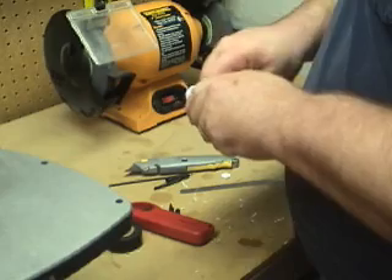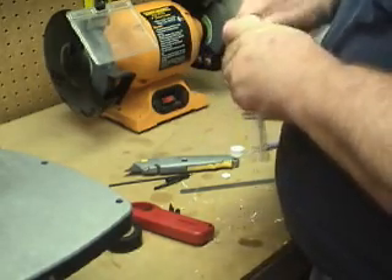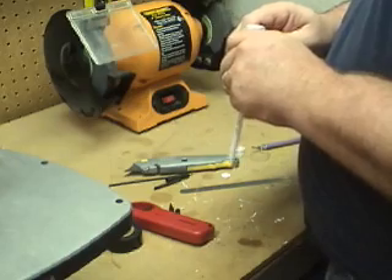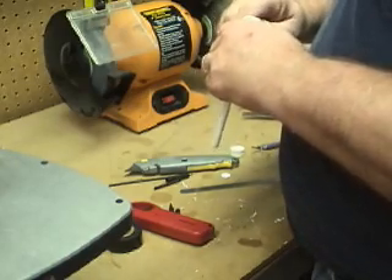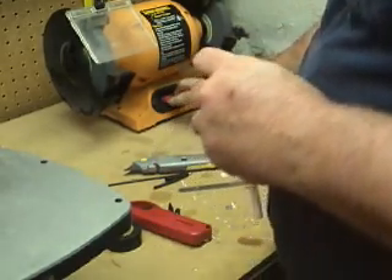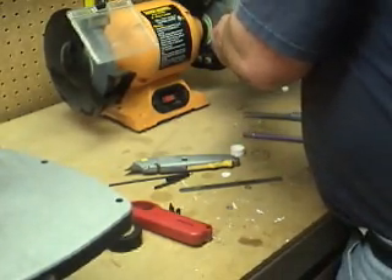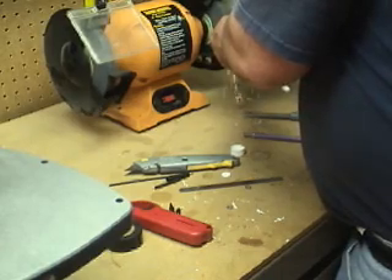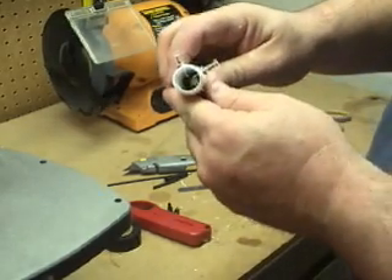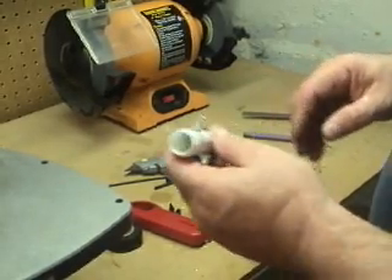We'll get the next one at about 20mm and push it in. Now they've got a pretty good alignment. Looking at the electrode gap, it's a little tight, so I'm going to grind just a little bit off these. I like that gap right there — maybe an eighth of an inch. Now we've got our electrodes in and the gap established.